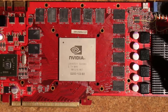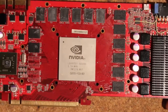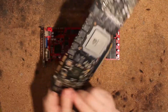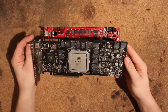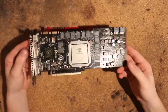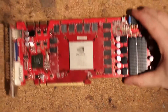There's also a Gainward version of them because they're basically the same company — I think they call it a Golden Sample or something like that. Anyways, I got this card and then tried to SLI it with this piece of crap here. This is a reference 55 nanometer that unfortunately has memory that cold bugs on DICE. I initially wanted to make a video showing the volt mods for both of them, but I think we're better off just using the Gainward — or Palit in this case.